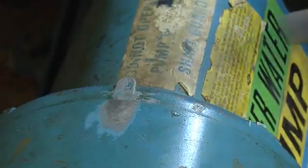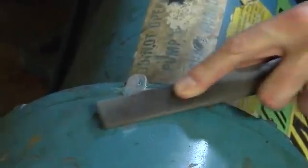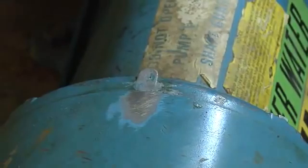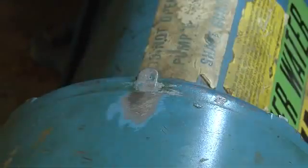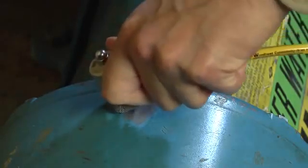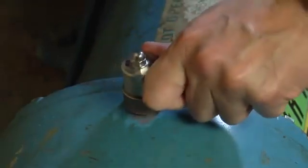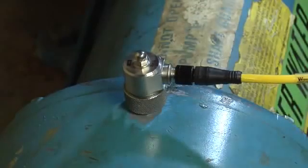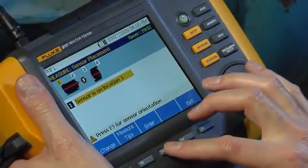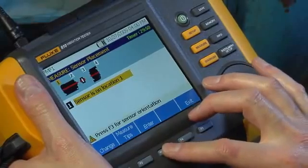Thick layers of paint, grease, oil, or other matter will reduce both the holding force of the magnet and the high-frequency response of the sensor. Take care when attaching a magnetically mounted sensor. Hold the sensor firmly and roll it carefully onto the test surface to prevent any jarring and potential damage to the sensor. Press F3 or Enter, or use the dial to select the orientation.